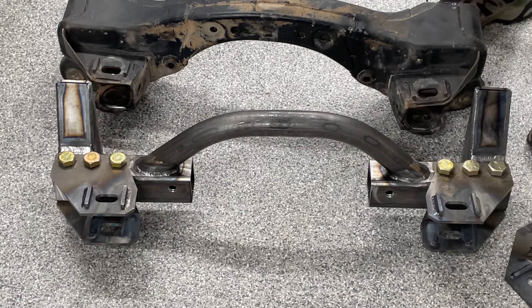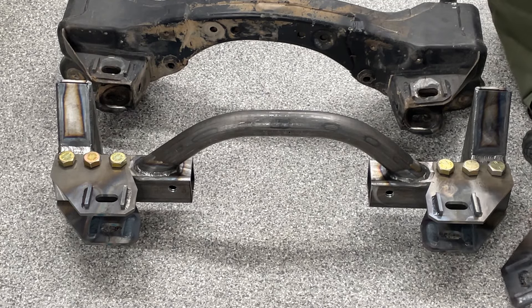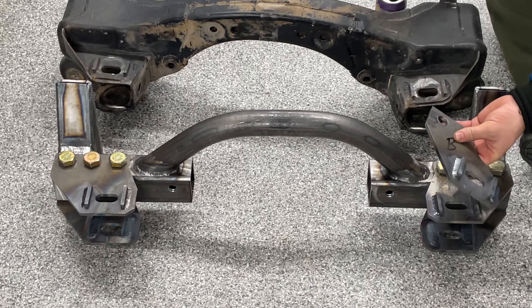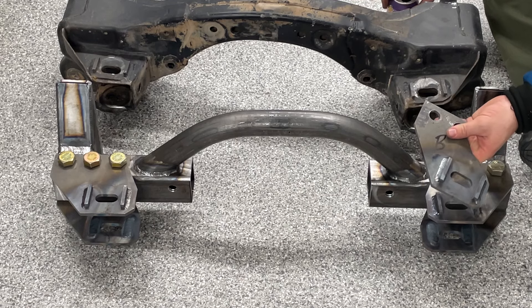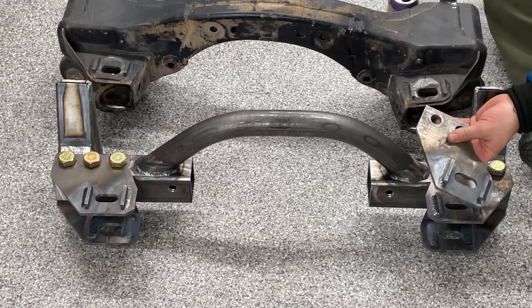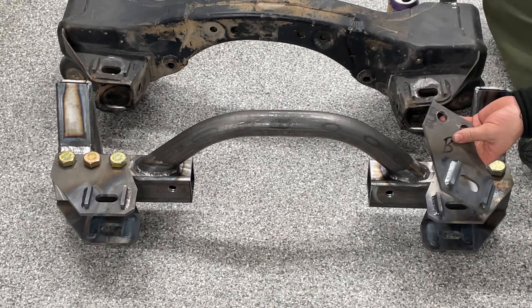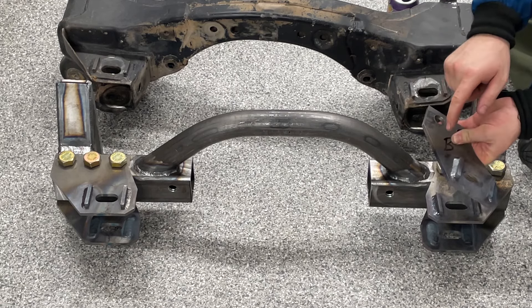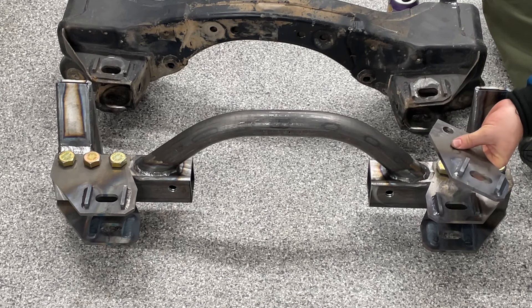In the world of welding, those have a big parallel — you relieve the internal stresses of the weldment by getting it hot. However, for welding specifically, because the heat affected zone is so hard, it is something called martensite — as in the metal physically changes phases and has a very hard, brittle microstructure in the heat affected zone. Whenever you post-weld heat treat it, it's at a high enough temperature to relax and convert that martensite down to a softer, more ductile grain structure.